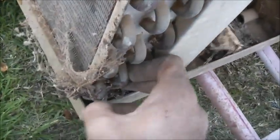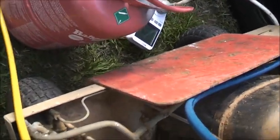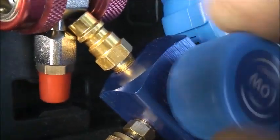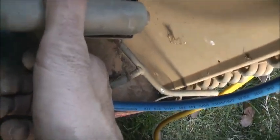You see there? Cold. We're cold there, but not there, so probably not enough in the system. It's not cooling. 5.2 amps. Current's gone up, turn it back off. Got one other way now. Nice and hot. 5.1 amps. I think that's enough in there actually.